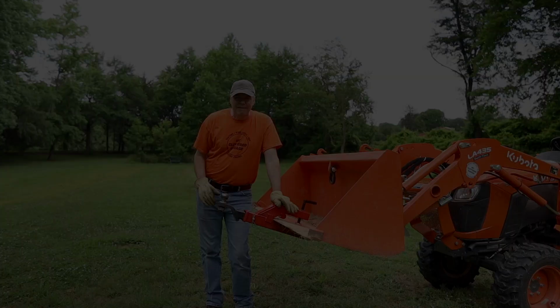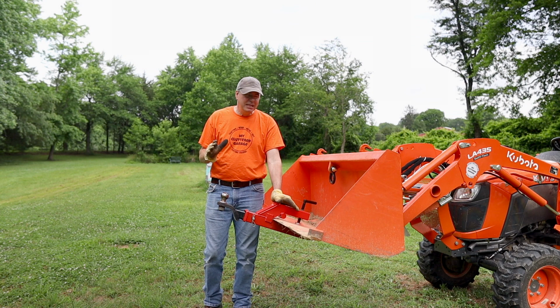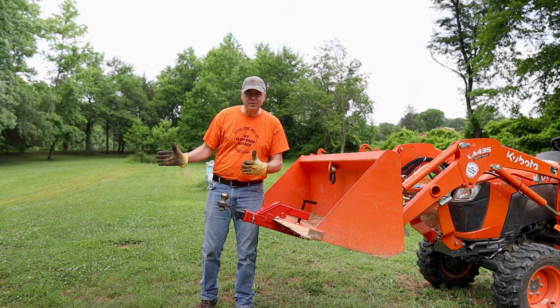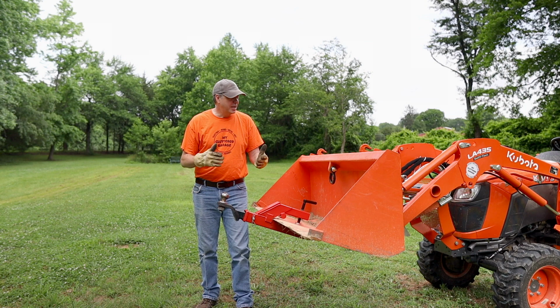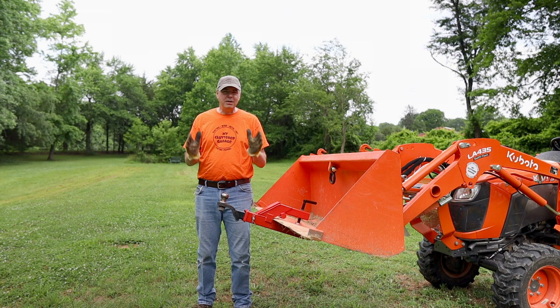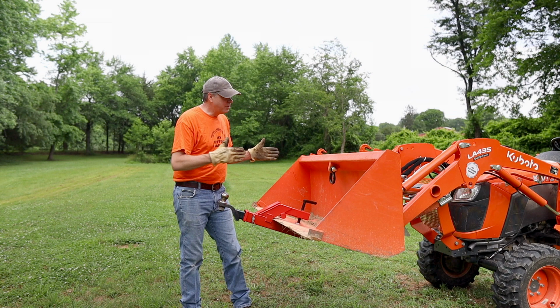First impression, I like it. Now, it's a little bit tricky, and like anything, it'll take some getting used to, but by having the ball way out in front of the tractor, when I maneuver it, it's almost like operating an articulated piece of equipment. When the tractor turns right, that trailer really goes far. So that part is a little bit tricky, but I think that's also really handy for maneuvering it. Like when you're backing in and you want to straighten the trailer up, you don't have to pull up and back in again.